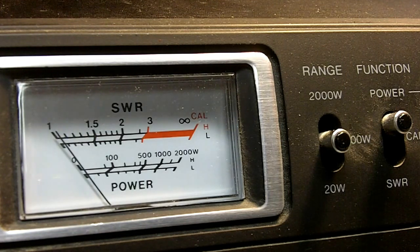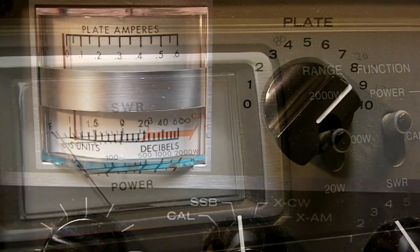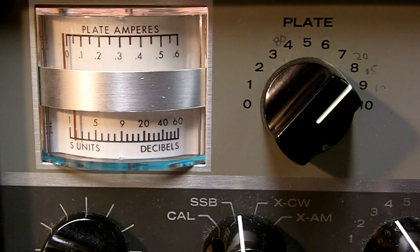These radios will usually put out more power on the 75 and 80 meter band on the lower frequencies, and as you get higher in frequency the power drops, but you can easily transmit with over 200 watts on these. The power input is rated at 300 watts PEP sideband, 260 watts CW, and 260 watts PEP on AM. I have a watt meter hooked up here on the 200 watt scale, and I'm right at full scale where I did my tune-up on 20 meters.